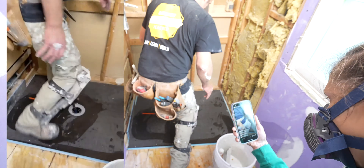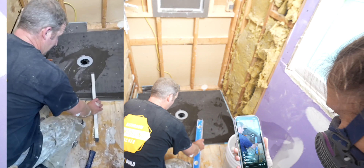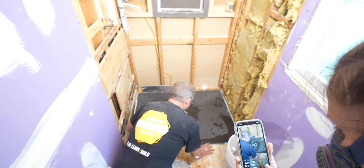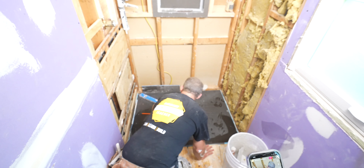Now that you have that rabbit joint, when we go to waterproof this we'll fill that with sealant. That board kind of goes halfway down into that pan, so it's important to make sure you provide that space that's needed. Since this is curbless, they provide you these little strips that you can seal into place. This is nice and level with my floor now, and then everything pitches quarter inch per foot. It's always good to double check and make sure you paid attention to how everything's set.